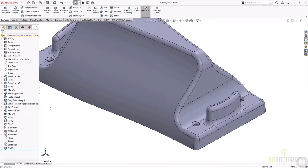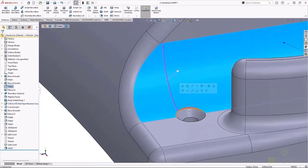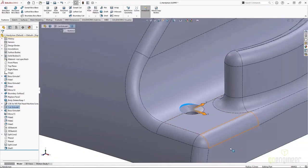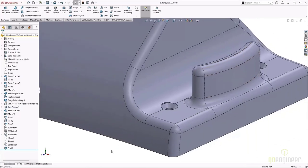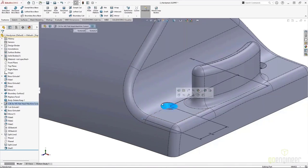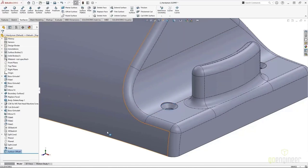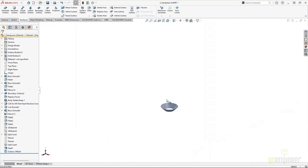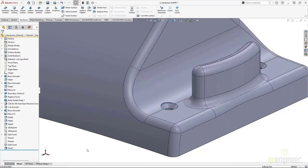When we look back at our design to see how the fillet comes down relative to the counterbore hole, we needed to use an extruded cut to remove some of that excess material. And that cut doesn't look right now for our countersunk design because of that fillet. We could use copy surfaces — offset a surface to zero and use that for trimming operations — but that seems like a lot of work. Instead, we're going to use the Delete Face command, which is on the Surfaces tab.